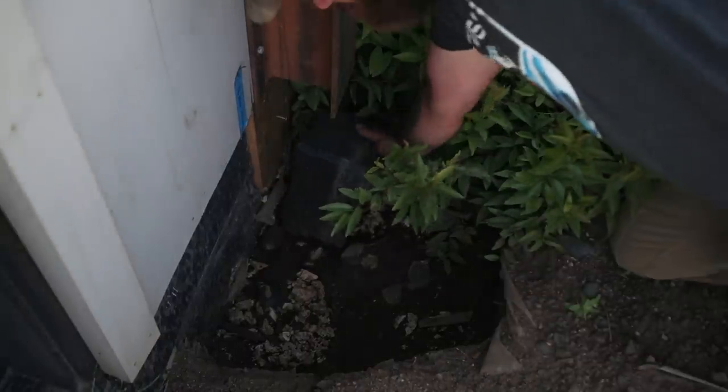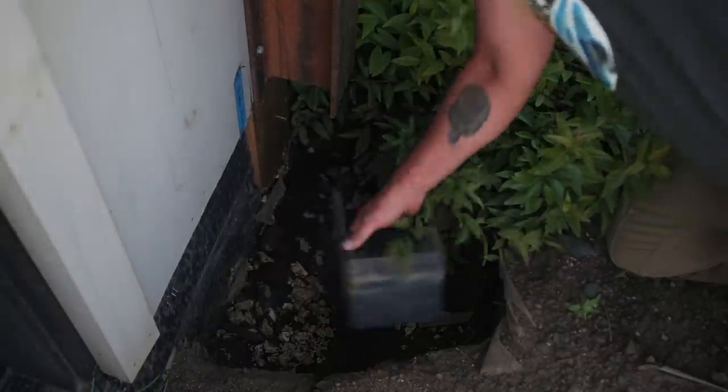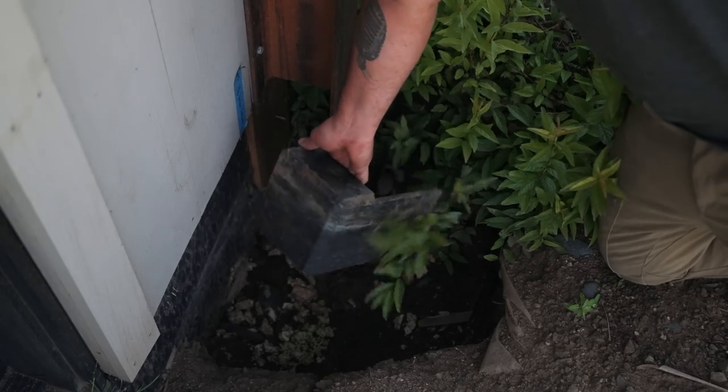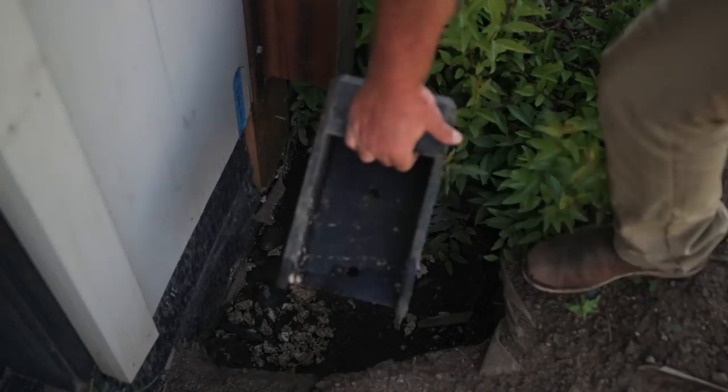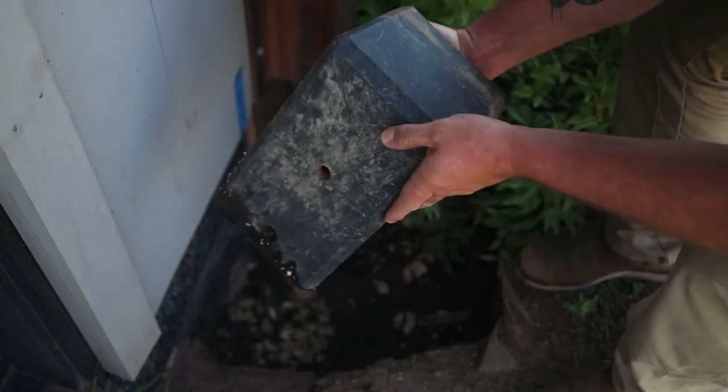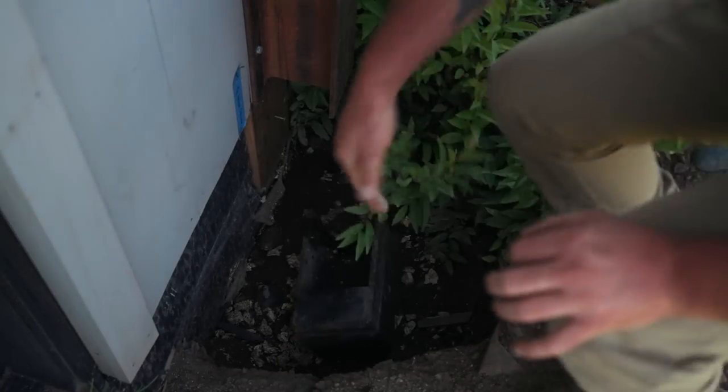These bases are made out of half inch plate and they're gonna be wedge anchored into the concrete foundation, which is supporting the post, which is supporting the channel, which is supporting the handrail. And that's how the whole thing works. I didn't design this, this was all engineered. I'm just the welder, but that's the purpose of the whole structure.